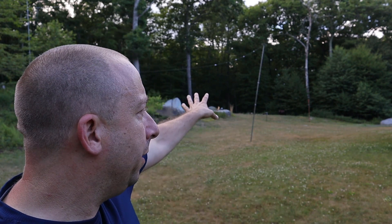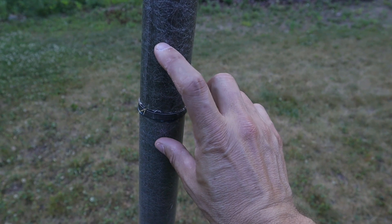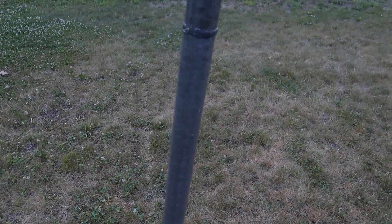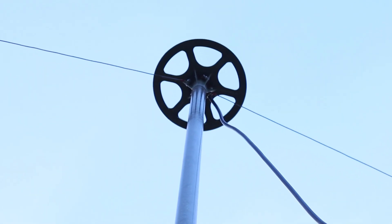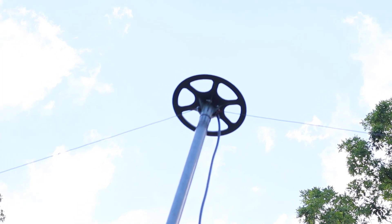To give you a basic overview: you may be able to see over there behind me the center support for the antenna, which is comprised of four sections of surplus military fiberglass canopy poles along with one of the canopy spreaders on top. On either end of the dipole I've got two sections of the fiberglass pole supporting the ends. Here's a closer look at the center support — four sections of surplus military canopy poles pushed together and held up with a piece of rebar pounded in the ground inside the poles. Up at the top I've got one of the canopy spreaders as my center insulator, with the two legs of the dipole coming off opposite sides.